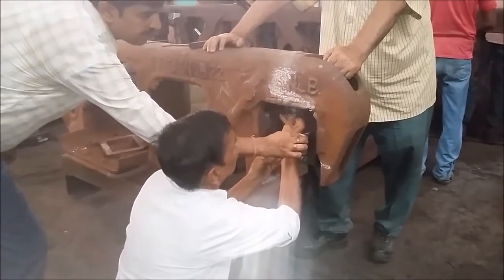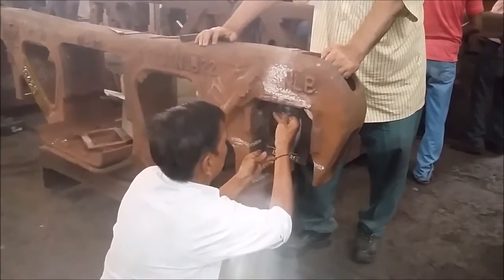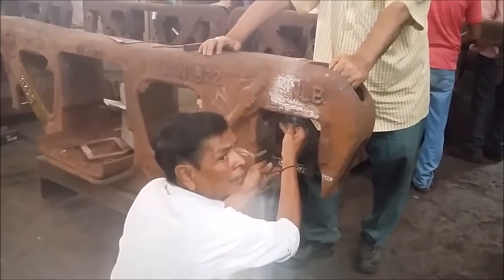The wear is reclaimed with the help of suitable liners welded on the surface of the pedestal jaw. This is done in every ROH of the wagon.